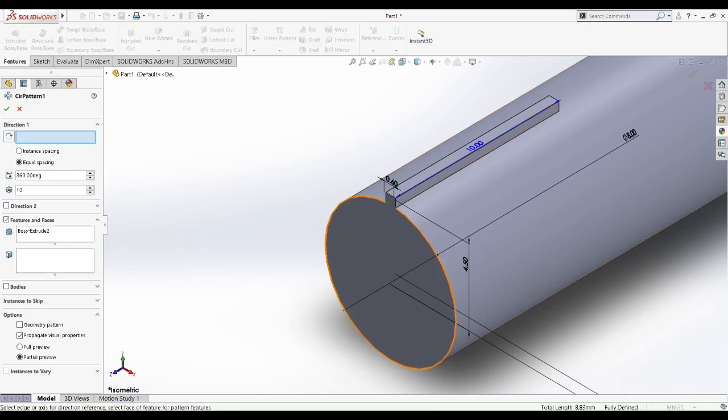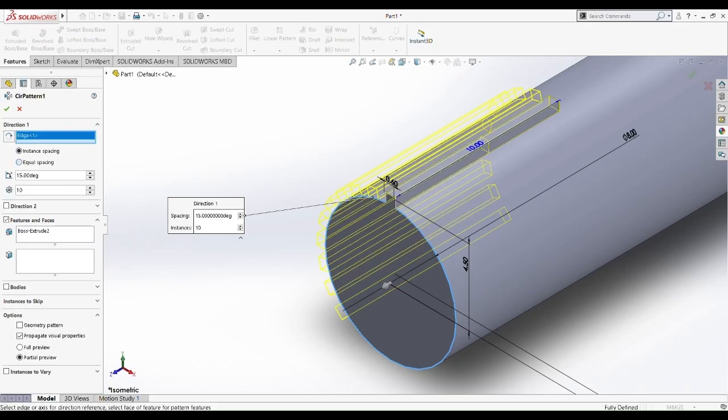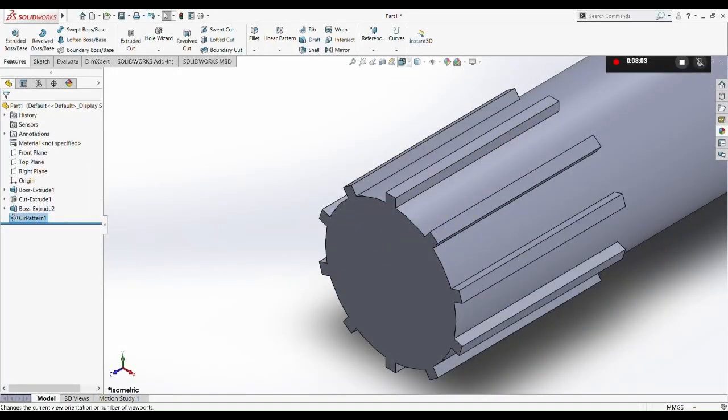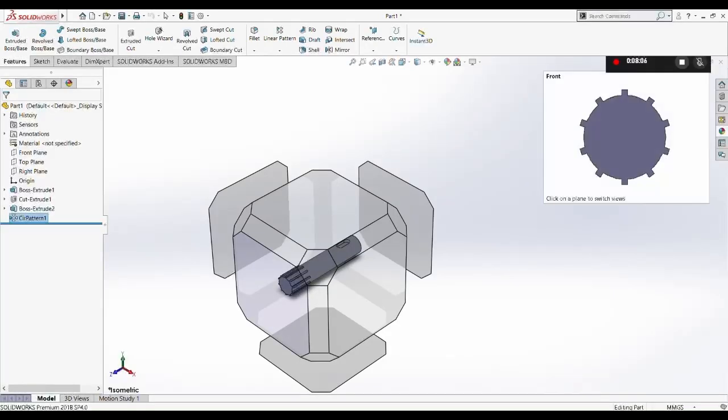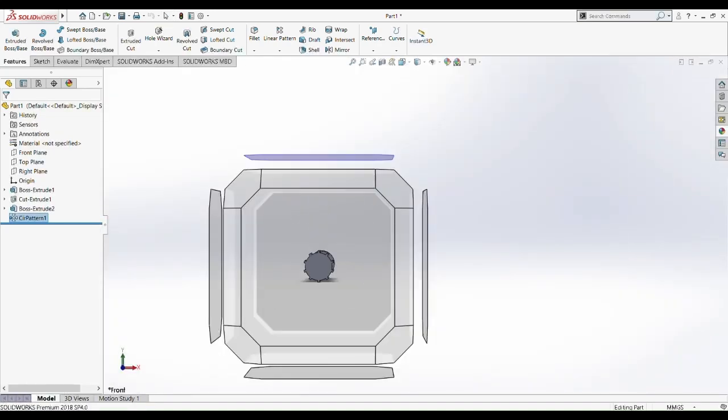So we then press the outer ring of the circle, and then we have a circular pattern. So pick 360 degrees, and then determine 10 shapes. There's a function for how many shapes of the rectangle you want on the circle. So we put it as 10.